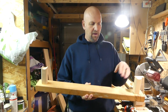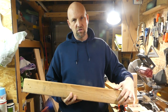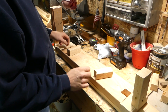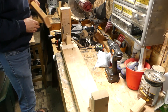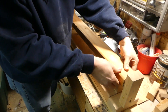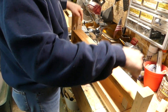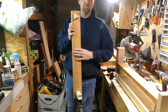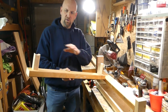I'll show you the jig I made so I don't have to measure every time. Ultimately I'm going to put two screws in each upright, so you want to pre-drill the screw holes. The jig has three boxes — the piece goes in these holes, then you set a 2x4 on top, drill the two holes, screw it in, and pull it out ready to go. It ensures they're all exactly 26 inches, which is the width of my track.